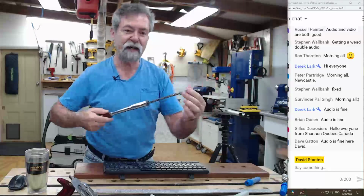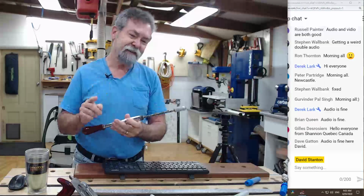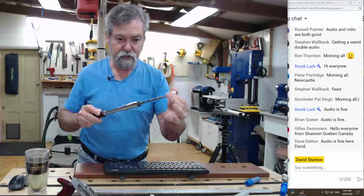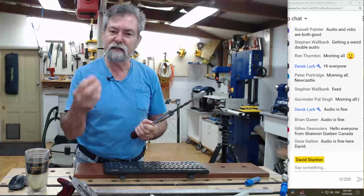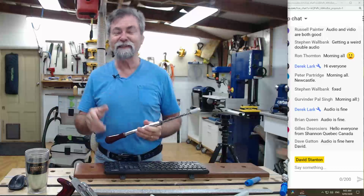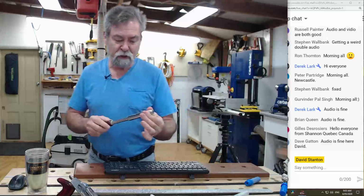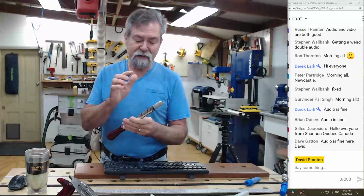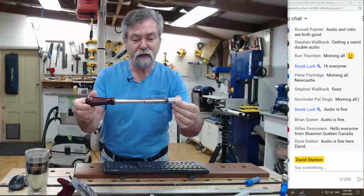Anyway, when I first got it, I could hardly move the thing. It was all gummed up. So ordinarily you're supposed to use graphite powder in these. A little bit of graphite powder down there and on the thread, I should say, and away it goes, and it doesn't attract any dust or dirt that gets pulled back into the mechanism. But I couldn't find my graphite powder, and I was a little bit excited, so I put a dollop of oil in there and then wiped as much of it off as possible. Now, it's not going to get any work outside that I think of anyway, but it's magic. It's so nice. This one's made in West Germany. It's a Stanley made in West Germany. Can you believe it?